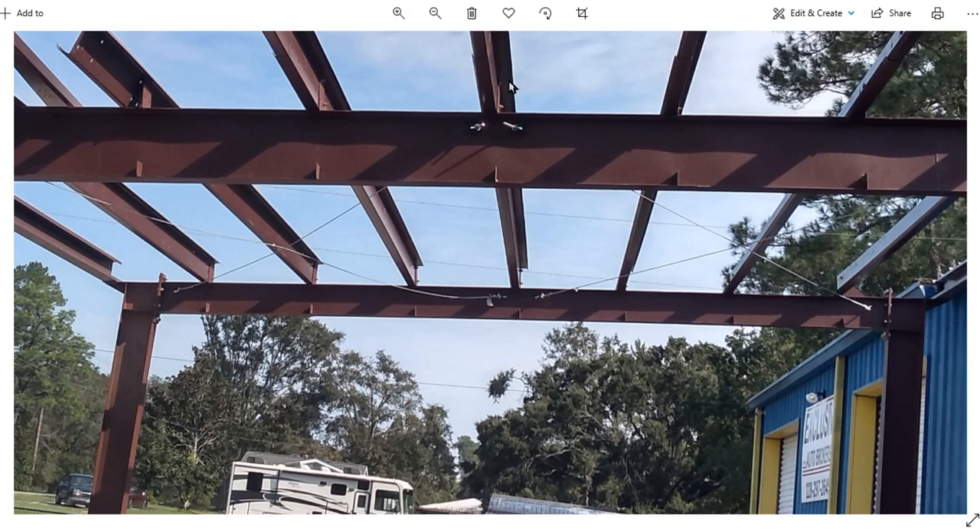You're going to hang one rafter and hang one side off that rafter, so when you hang the next rafter you're ready to go and stick those cross braces in there quick. It's going to keep this from racking and falling over. It's okay when you've just got a column and a rafter, but when you start putting all this weight on here, these rafters start to think about buckling.